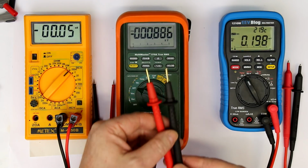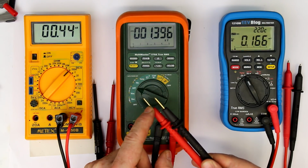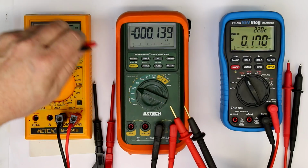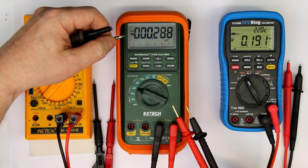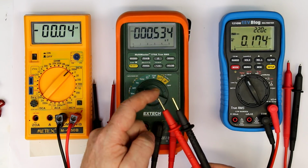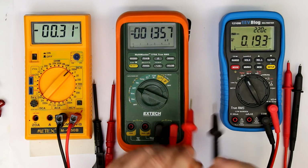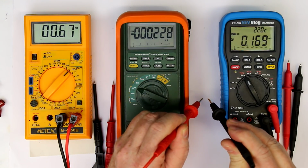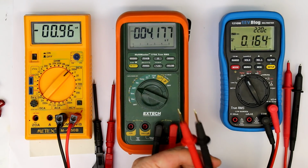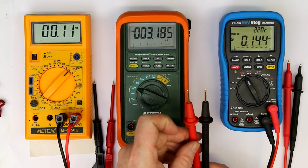These are the original probes that you got with them, and I hope you can see that these are gold plated. This is of course an important feature, because the non-plated probes, like this one here, which are at best nickel plated, if at all, you just get better contacts, especially in continuity testing. And one of the most important features is how sharp they are. The reason is when you're probing, you have to poke through the oxide layer that evolves on nearly every kind of component or solder junction. So the sharpness of the probes is extremely important.